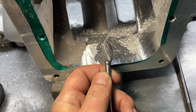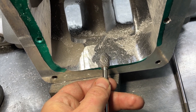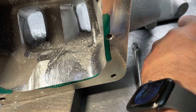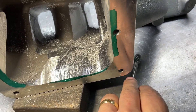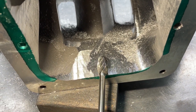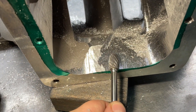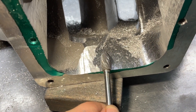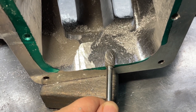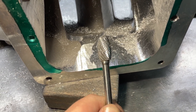The tighter the flutes, the more likely they are to clog on aluminum. So why have a cross cut? I use it for finishing. You turn down the speed so it's slower, and you can knock out some of the bigger ridges. The aluminum cut leaves the surface much rougher, while the cross cut leaves it smoother. But if you want to remove a lot of material with the cross cut, it would take forever. I use it to smooth out before moving to the next step.